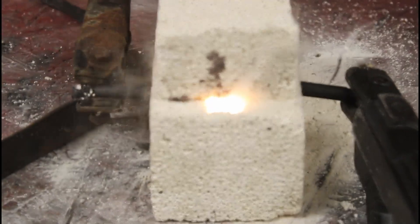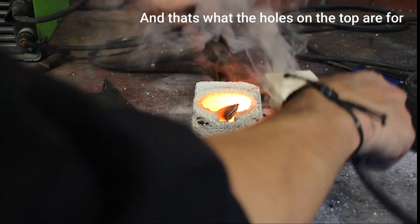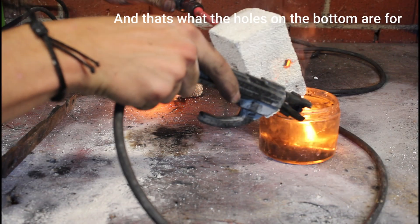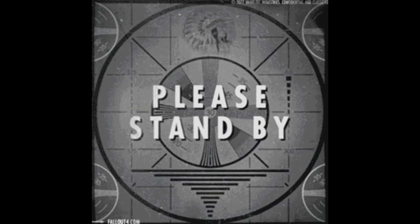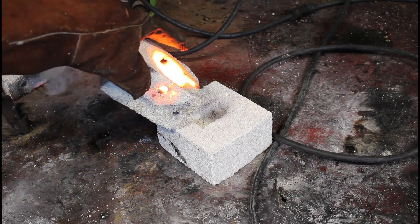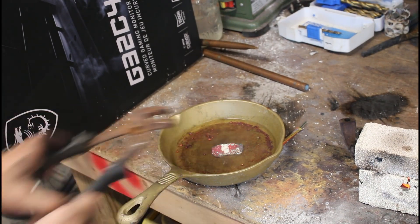After a few minutes the smoke dissipates and it's pretty good. After letting the forge heat up for a few minutes, I started adding some pieces of copper into it until it melted. Once it had a sizable amount of molten copper in there, I decided to pour it into a dish of water. I then went for a second test in a metal pan. After seeing that pouring molten metal into water is not a good way to make casts, I decided to make a little brick indent into a piece of fire brick. Even after a couple of failed attempts, I am quite happy with the results.